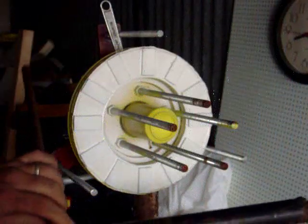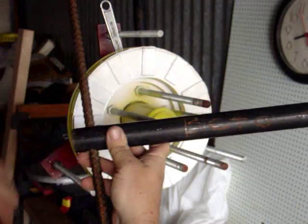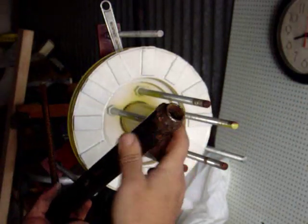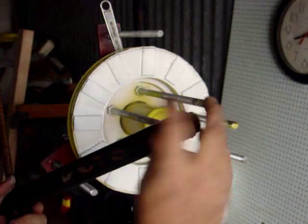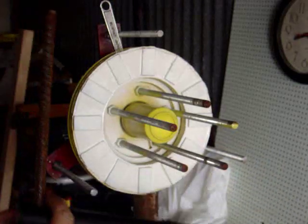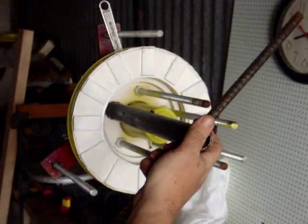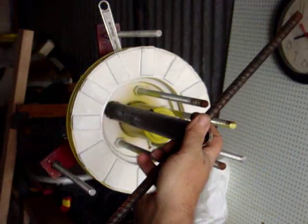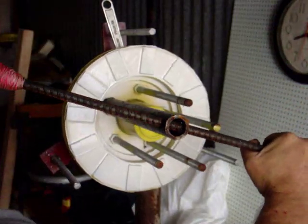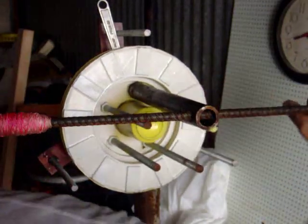So many months ago, a friend of mine came down from Brazil to visit for about a week and he signed this. It's B-E-T-O — Beto Carrera from Brazil. He did the welding on the end. I found a socket and we actually cut the end off the socket so that the all-thread would fit all the way through it. We made an extreme deep weld socket. Fits right on down there. I just got done drilling the hole. I got the wrench on the back. Nice specialty tool to make — anyone can make it if you have a welder and a good piece of pipe.